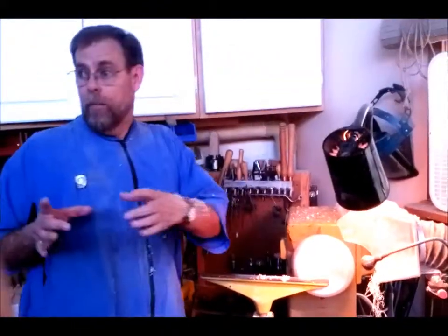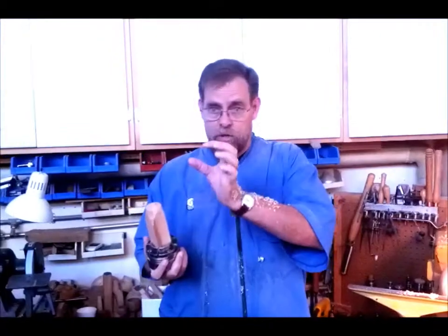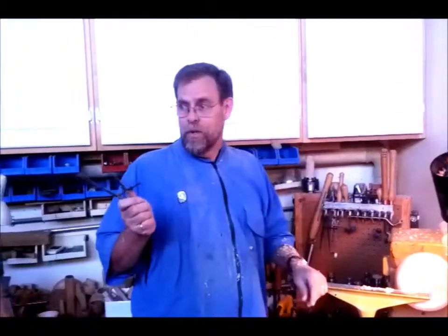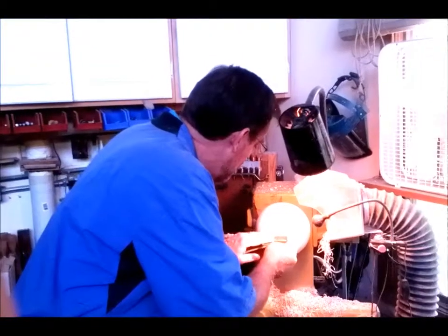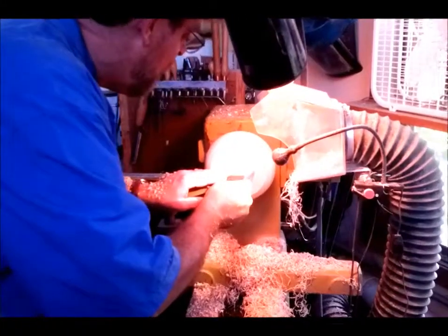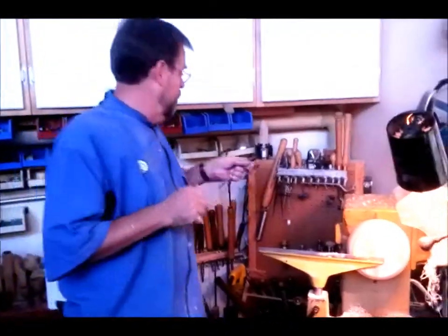What I need to know is, the chuck that's holding it is like this one, except I use this one when I was making tops for people. The chuck, when it's round, has a certain size, and that's the best grip that I'm going to get. So I know, because I said this when I started doing these today, that this is the right size. So if I can figure out an opening a little further out. Yep, that'll work. If I make an opening that size so that I can then put the chuck jaws in, when they open, they'll hold the bowl in place for me.